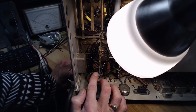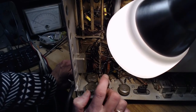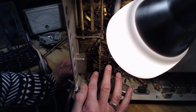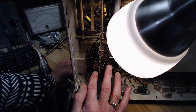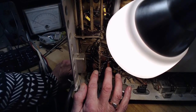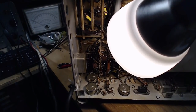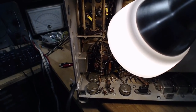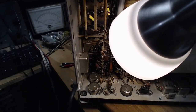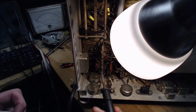So the reason it's exceptionally loose, even though it's soldered to a terminal, is the terminal is a socket terminal on the tube socket, and it's loose. So that's why this seems so flippy floppy. But it looks to me like I just gotta tack it back there. That's all I gotta do. Let's do it. And that's an original resistor. It's not something I ever changed.